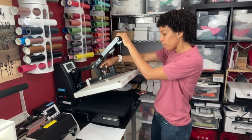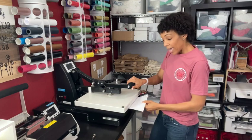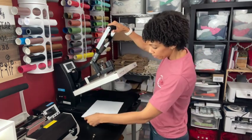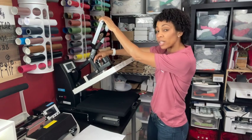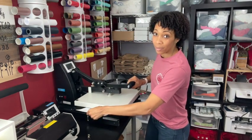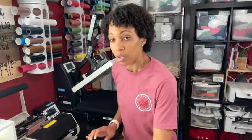I'm going to turn the knob a couple of turns, then test it again. I put the paper back in and close it — the paper is not coming out, I'm tugging on it. I check on each side to make sure pressure is the same all the way around. One side pulls out, so I bump it up just a bit more. After another adjustment, neither side pulls out. The paper test is passed — our pressure is good and we can start working on a project.